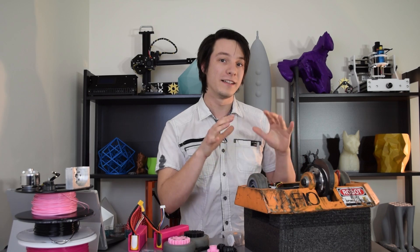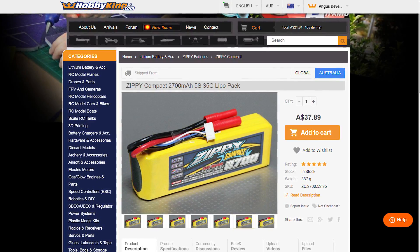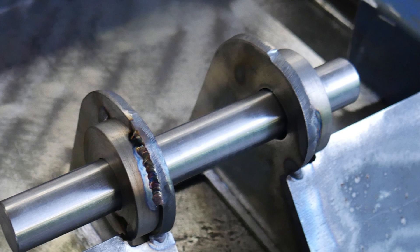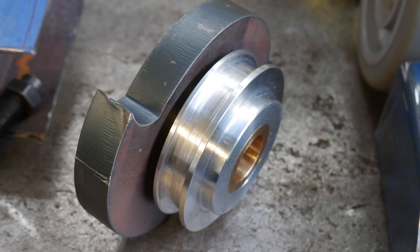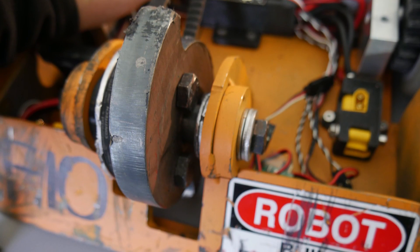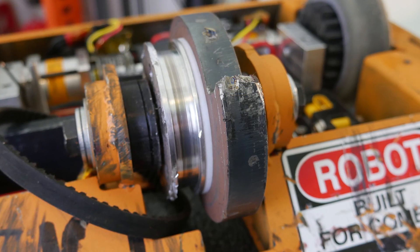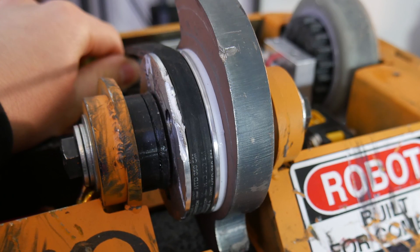It's running a five-cell lithium polymer pack. I went with Zippy Lipos — 35C and 2700 milliamp hour — and I'll actually only use this one pack during the whole event, just charging it between fights. Weapon hardware in Vanguard consists of a 20mm hardened rod with a bronze bushing to allow the disc to spin freely with some grease. The disc is 16mm thick Hardox, driven off the motor with timing belts. The belts are designed normally to bite into teeth, but we lathed them off on the output side to allow the weapon to slip on impact, which protects the motor — and it kind of worked, mostly, until the last fight anyway.